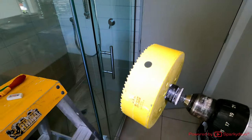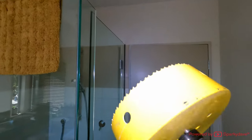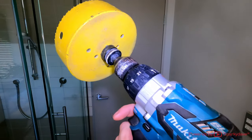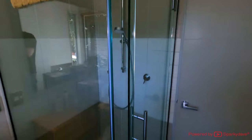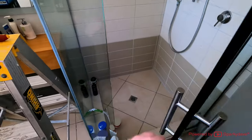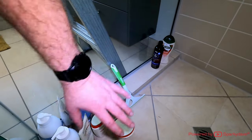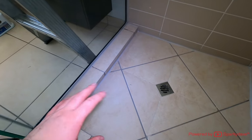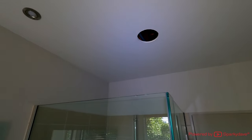I can place the grill up on the ceiling to get an overview of what it's going to look like when installed. Here I have my 160mm hole saw. I'm going to cut this hole without filming because I want to ensure I'm very careful using a heavy hole saw with a small hand drill - if it drops it may damage the glass or tiles in the shower. Before cutting I want to ensure a clean environment below. I'm going to move all gear out of the shower so it doesn't get coated in debris, and I'm going to throw a drop sheet down so chunks of dust don't go down the drains.